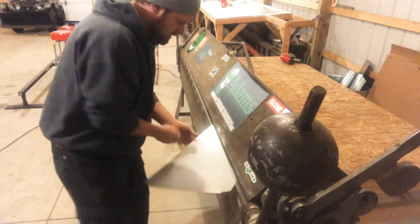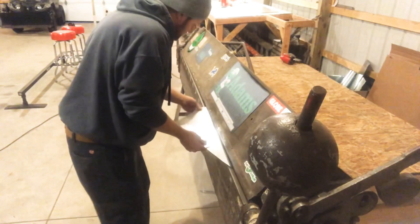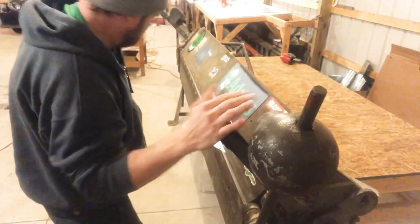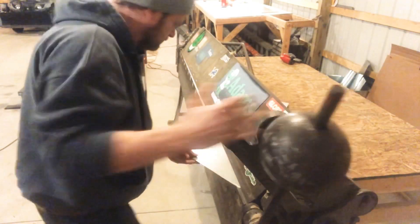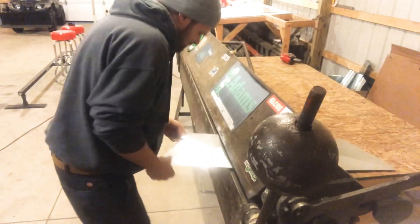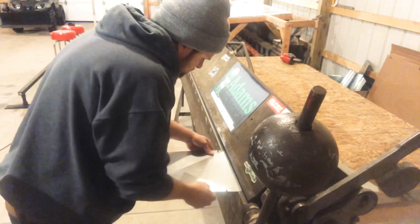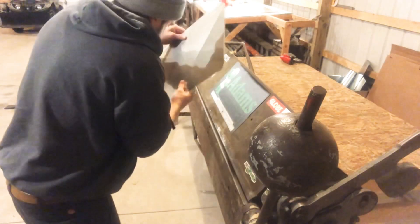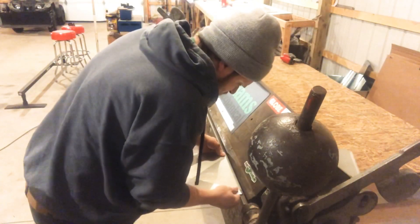Got your markings, and the other side's the same. Let's fold this piece up. I always cross-break everything. Cross-breaking puts a little straightness to it. I'm going to start with folding this quarter inch, then go to the other quarter inch at 90 degrees, and then we'll go to our middle sections.